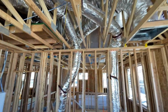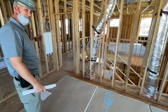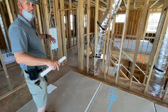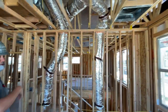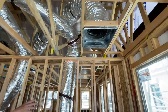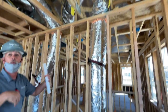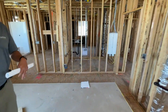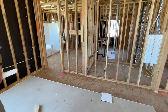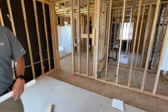And like I said, with these vents that we're putting in, a lot of times you remember if you ever upgraded your carpet and you go to shut your door in your house, that was the only airflow under the door. Your room would get stuffy or too cold. So now we put these big vents in so that when your door is shut and the AC or heater turns on, it still circulates and gets pulled into the hallway and cleaned. Especially at times like right now with COVID, you're sitting in your room and you're sick. You don't want to sit in here for a week and a half breathing your own sickness. This way it goes back up through the ceiling, back over the filter, and gets cleaned before it runs through your home.